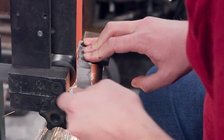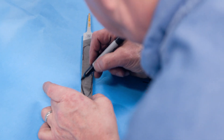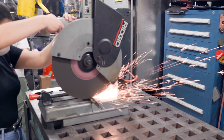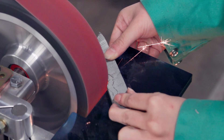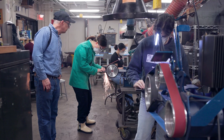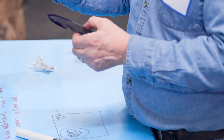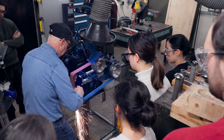In the first day of the class we practiced just the grinding technique that is essential for all knife making. You pick up your piece of metal and after drawing it with a sharpie or something, you go to the abrasive saw or the bandsaw and you're just cutting that shape, trying to get it as best as possible, and then go to the grinding wheel. You're grinding out your shape so that it's a smooth little blade. To learn to grind something that is flat and parallel is the best way to figure out how to grind it.